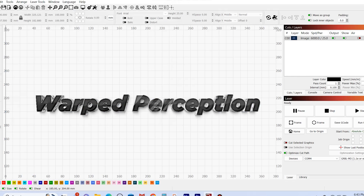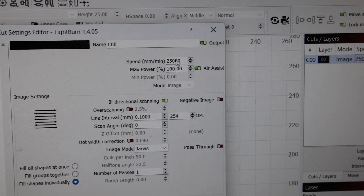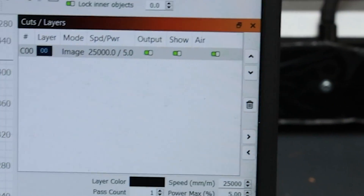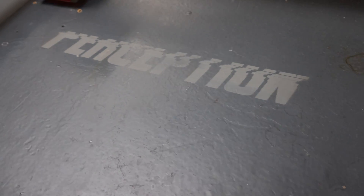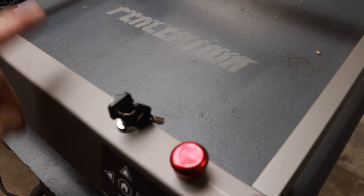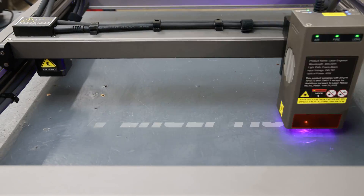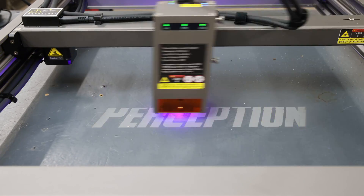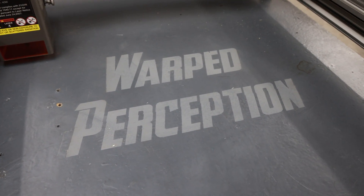For my first test I'm just going to engrave my channel logo right onto this tabletop, and then set it to maximum speed of 25,000 millimeters a minute. I stopped it because I'm not really sure what happened — maybe a new logo was born but I really don't like it. I think the frame moved because the laser is just moving too fast. I'm going to put a couple of sandbags on it and try it again. I'm all done with that test and as you can see it came out pretty good except for that glitch, but I'm bored of my logo.